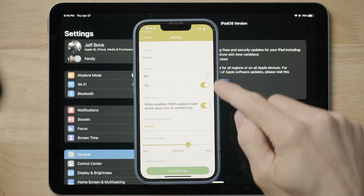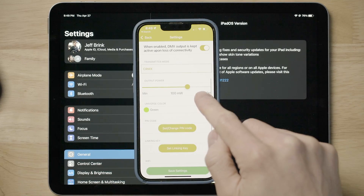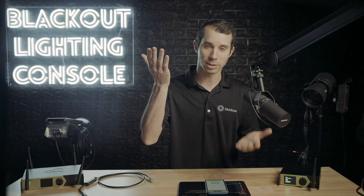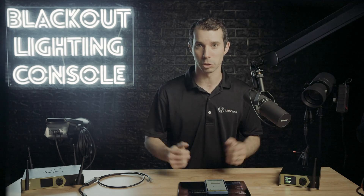From here, I'm going to make sure that it is in transmitter mode, and I set my output power a little bit lower because I want better WiFi performance. From my experience with the Rat Pack AKS, I imagine it's similar in all these devices — the more CRMX power, the less WiFi range that you have. So if you even them out, you can get a little bit more WiFi range if you don't need a ton of transmission power.